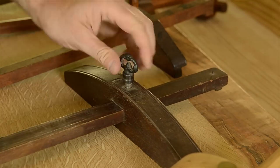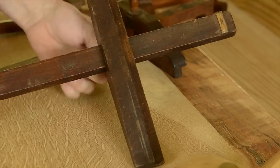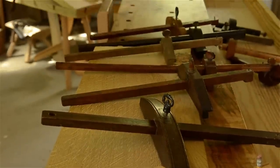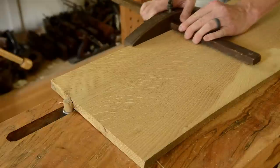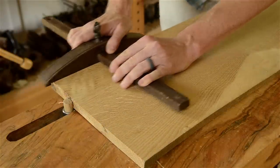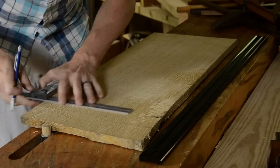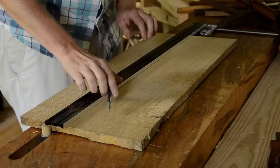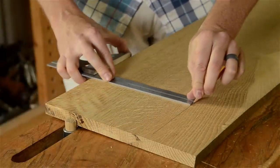A panel gauge is like a very large marking gauge, used for sizing your board's width to show where to rip the board if your marking gauge isn't long enough. Not many companies make these new, but they can be found on the antique market. Most are a bit wobbly, but I've found that's not a huge problem if you hold the gauge fence steady when using it. You can sharpen and rehab panel gauges the same way I showed in my video on marking gauges and mortising gauges. I would categorize panel gauges as a nice-to-have tool, but not a necessary one — you can achieve similar results by measuring at each end of the board and striking a line with a straight edge, or using a chalk line for a longer board.